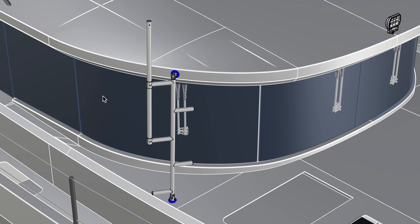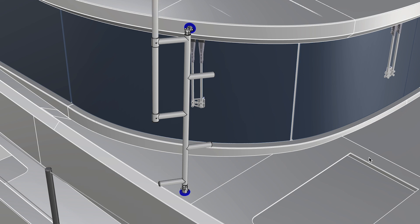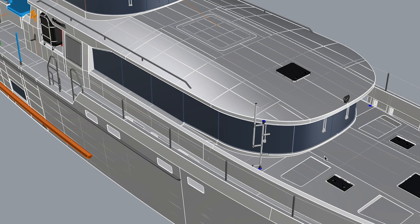The other option we have is quite a bit more neat and quite small. This is what I call the witch ladder, but it's quite similar to a diving ladder. Essentially what this does is it fits between two Sea Smart fittings in the roof of the lower accommodation and the brow of the main saloon. Then this pull here can be pulled up from its resting position upwards to create a handrail. This latches in place using the two Sea Smarts, each of which has a holding force of over 1,500 Newtons, which I'm sure we can all agree is more than enough for most people. This allows safe passage onto the roof whilst also having a closed length of just over one meter, which makes it very stable and means it's not in the way when you're under passage.